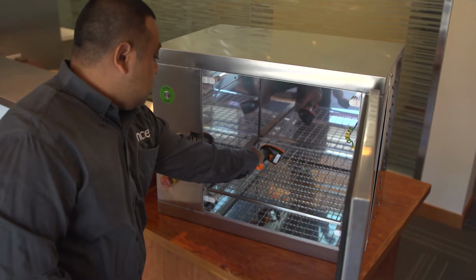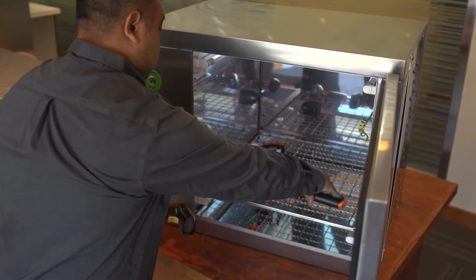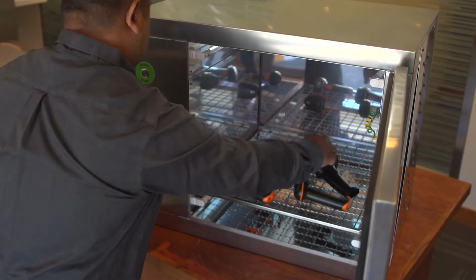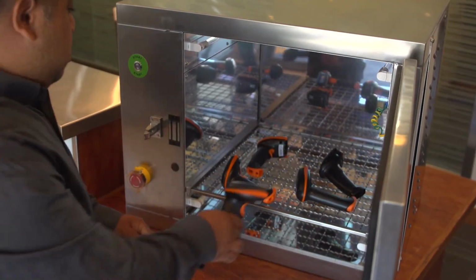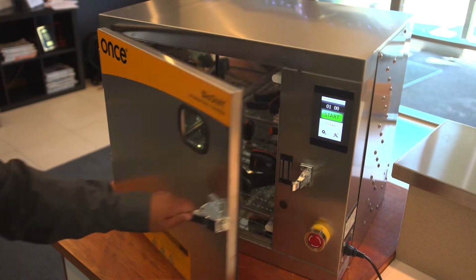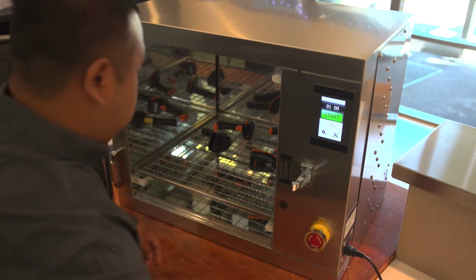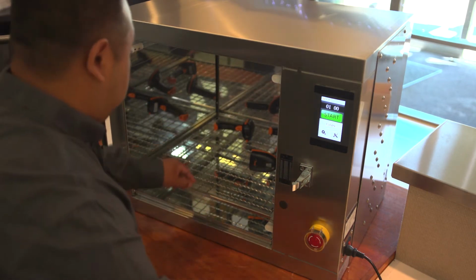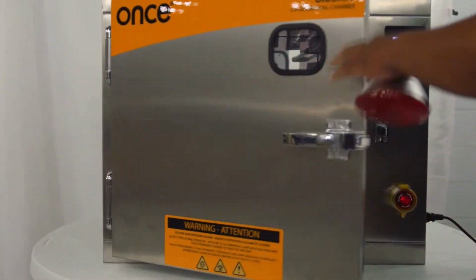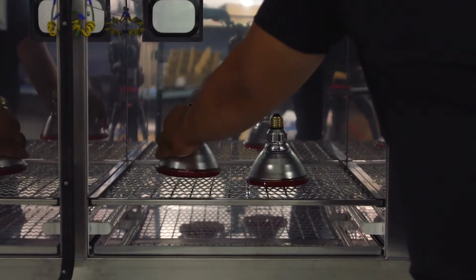People often ask what size and weight objects can be disinfected inside the chamber. To allow for a variety of objects to be disinfected inside the chamber with minimal shadowing, the design of our mesh tray is dual featured. It's structurally sound to support a sufficient amount of weight, while the woven stainless steel grate minimizes the number of contact points that create shadowing on the object. This allows for UVC exposure to reach around the entire object inside the chamber.